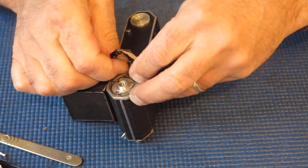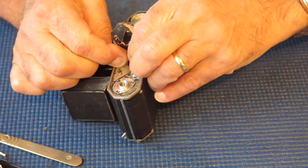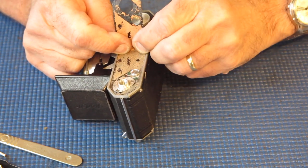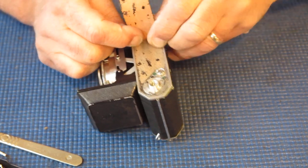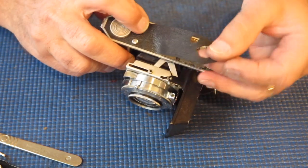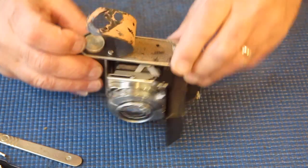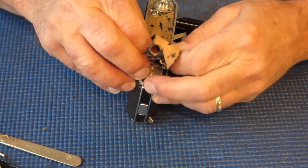This is genuine leather on this camera and it's peeling back fairly easily. You can see it's leaving leather fibers on the surface, and that tells me that the adhesive was very good. Usually when I'm doing the leather on here I want to get it right back to this stage, because otherwise when you glue it back — if you were only to peel it back partway and glue it back — you'll end up with a visible line where you change from the fresh glue to where it was previously stuck down. If you can force that line back further, then it effectively becomes invisible.